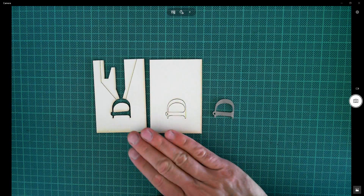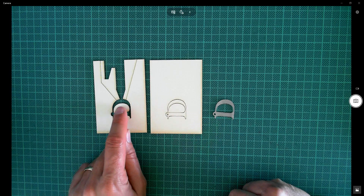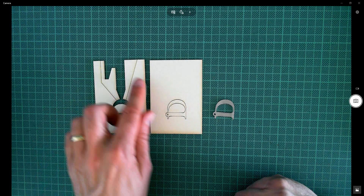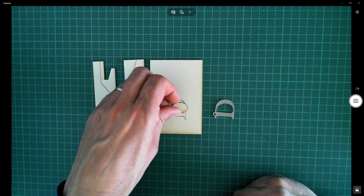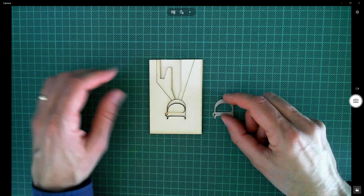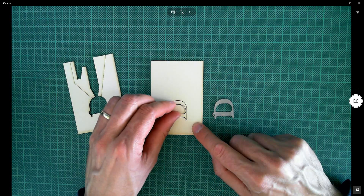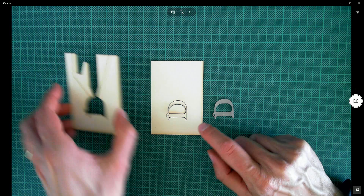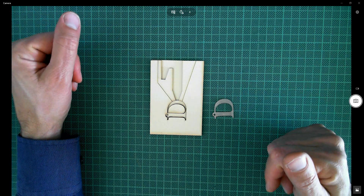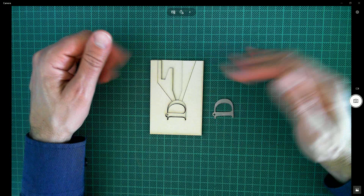I've made this using some card molds — here they are. There are two parts to this card mold. I've had to make this backing piece here because for my D I've got this internal cutout to apply. If I was doing a letter like a J or a T I wouldn't have this issue. I could simply cut out the profile of the letter, but for the D I need to know where to place this internal cutout in alignment to the rest of the mold. To do that I've had to laser engrave just the pattern onto a separate piece of card, put a bit of PVA glue and stick it down, leave it for a few minutes, and then that creates my mold. I've got my well and my runner here where I'm going to pour the pewter in from our low temperature casting machine, and I've got some risers here for the air trapped in the mold to escape as the pewter pours in.